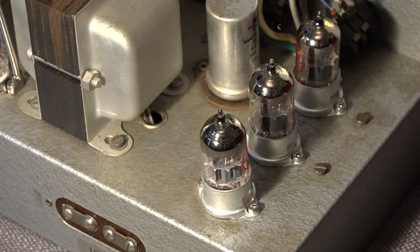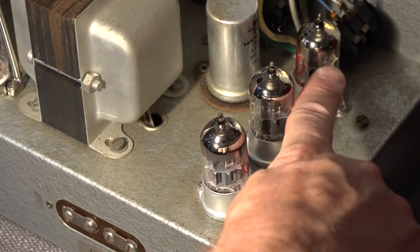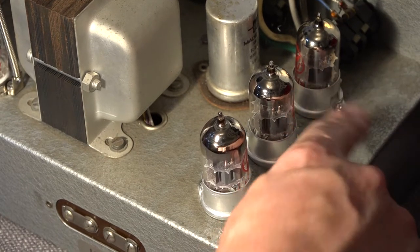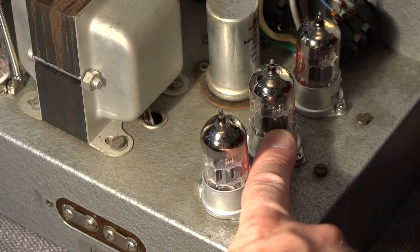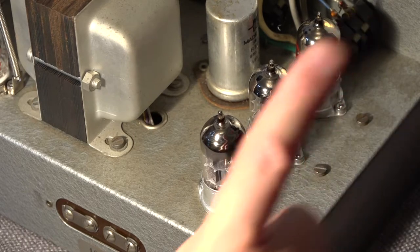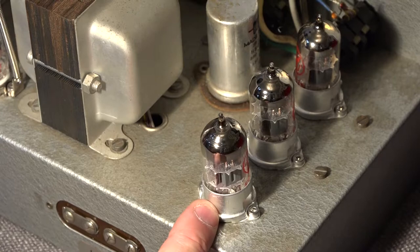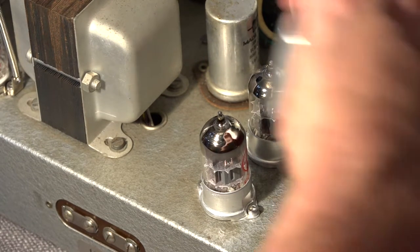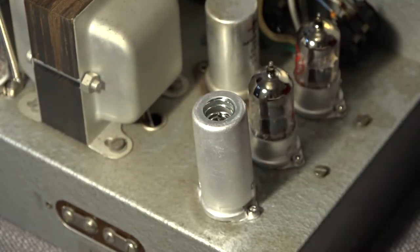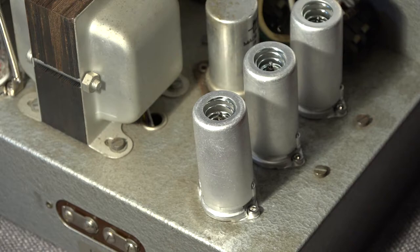It would appear I haven't documented everything I've done on this amplifier on video, so I'll take you through everything else. These three valves here are the three ECC83s. The front valve is the input valve for channels one and two - that's their preamp. The next valve takes those signals and the gram input, which is at a higher level so it doesn't need a preamp valve, and it feeds the tone control circuit. Then it comes into the phase splitter. These valve bases were slightly different to the originals in that they were rotated, so I had to extend some of the wires. They do have rather nifty valve covers to keep the valves in place when the amp is being transported.